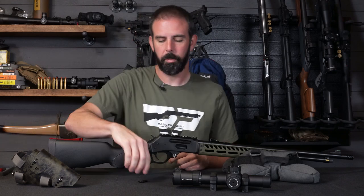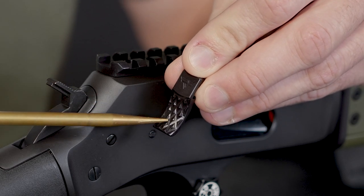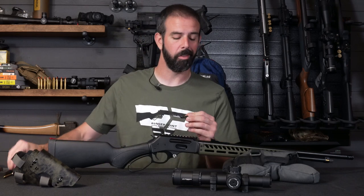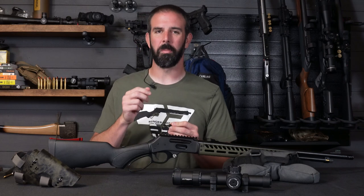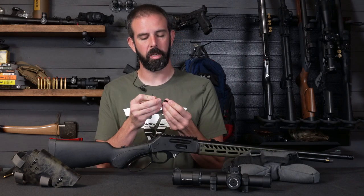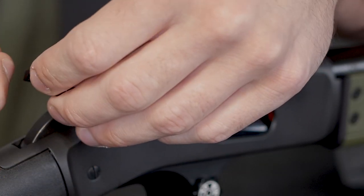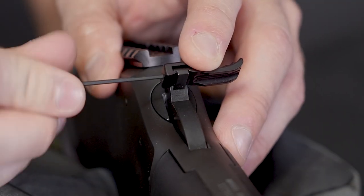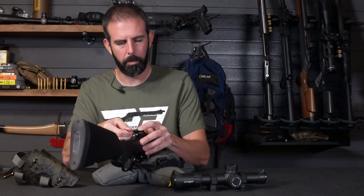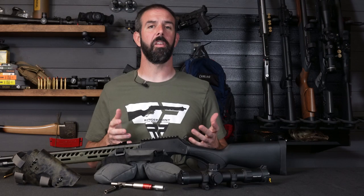That's all there is to that. Next up is a very simple thing — this hammer extension. One thing I love about this hammer extension: you can see all these little mountain peaks — those are very aggressive and make it so easy to get a nice solid purchase, especially if you have wet or sweaty hands. You don't slip off of this like you would some of the rounded ones that are just lightly knurled. They did a great job designing this. All it is to set it in place is a small set screw. Just wind that bad boy out, then slide it on here and crank it down. I would put some blue thread locker on this eventually, but I'm going to see how this holds up first. Don't strip this out — this is aluminum — but definitely get it good and snug. That's two of four installs out of the way.